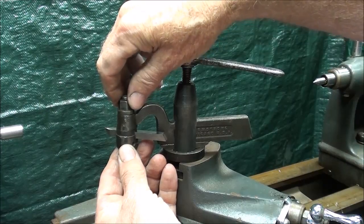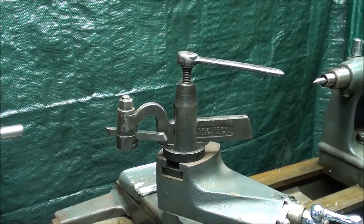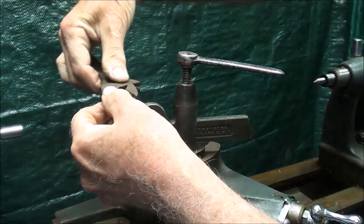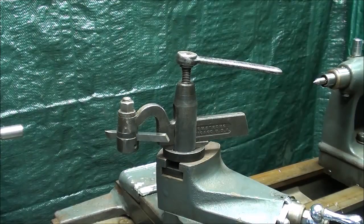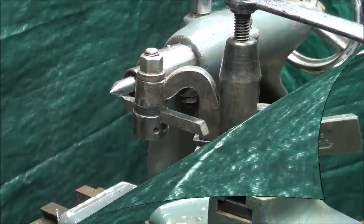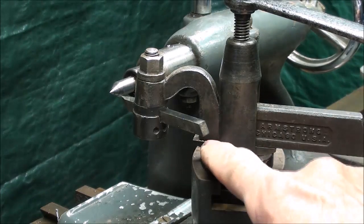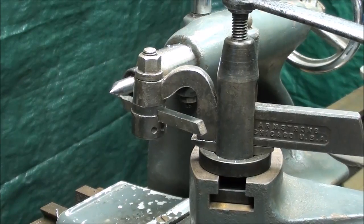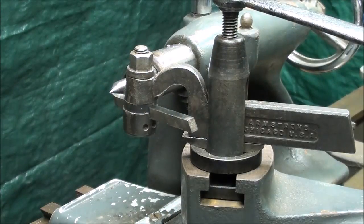Make sure that you have a ring and a rocker on your tool post. I've seen people try to use it without the rocker — they don't know it's supposed to be a rocker — but that's what allows you to adjust the height. And I'm right on center. You do not want the tool to be above center or below center, however you're probably a little bit better off to have it slightly under because then it doesn't tend to dig in.